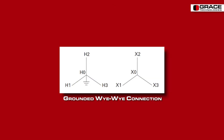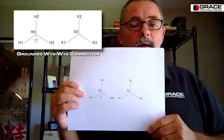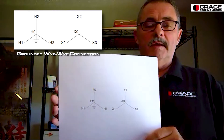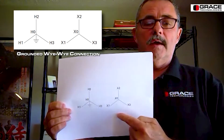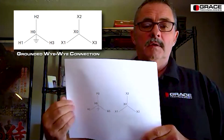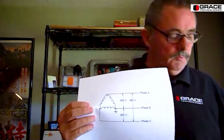Anytime there's imbalance that you can see with your multimeter, you can also usually see some of that on the voltage indicator. These configurations — whether it's a tapped center-tap Y with ground or not center-tapped — would normally be balanced. If you have a floating ground, and there are some facilities in this country that are floating ground with no continuous ground connection, if one of those phases goes to ground, that ground light will light up. It can indicate a phase-to-ground fault, and you may not have another indication — that's why ungrounded facilities were originally built, so a minor failure wouldn't cascade back to the main, like in the original coal plants.